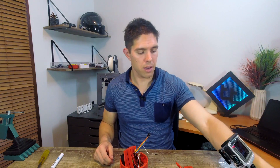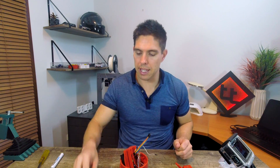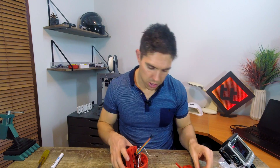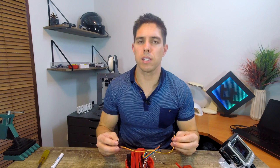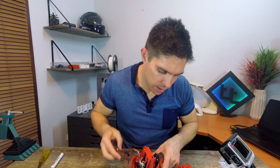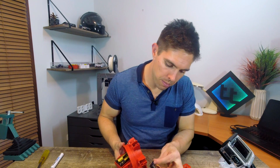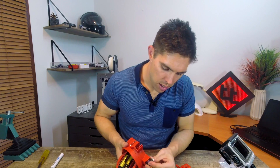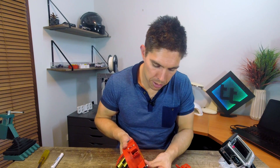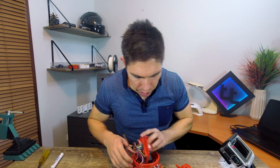All of the old servos are out, so I now have a pile of legs, knee joints, and all of the nuts and bolts from the servos. The next job is to start doing everything we've just done but in reverse. We're going to take our numbered servos and thread them back in, matching up the numbers on the legs and also on the hips. Servos 0 to 5 are the ones that go on the hips. Rotating the chassis to show zero, just like we did the first time, we're going to do it from the bottom. The wire needs to face to the outside and the little bump faces to the inside. We're going to push it in until it has that satisfying click, then thread the cable through the hole immediately next to it and pull it through out of the way.